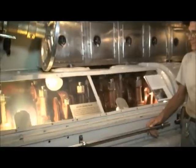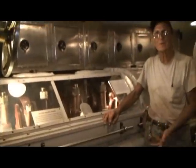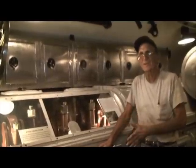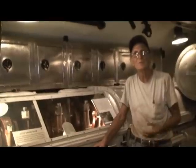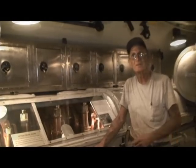This is the after engine room. We have one of them cut open so you can see the inside. These are unique engines — they have two crankshafts, one on top and one on the bottom. They're called opposed-piston engines because you have two pistons coming together in the same cylinder for your compression chamber. The top piston is your intake valve and the bottom piston is the exhaust valve, which makes them very reliable. These were the best engines they had, and they're still making them today exactly the same — using them for emergency generators on nuclear submarines.